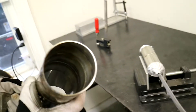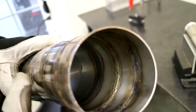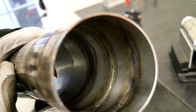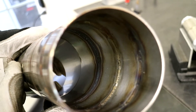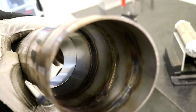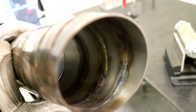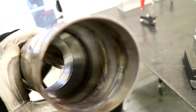The reason that you do that with stainless is it's a reactive metal and it will sugar on the inside if you do not back purge. I don't know if you guys can see that or not, but the first two were back purged and they have a nice color and look like a normal weld. But that back one in there was not back purged and it's got some sugaring — and eventually it will break down the weld and the weld will fail. So that's why you need to back purge.